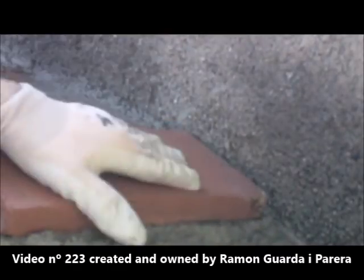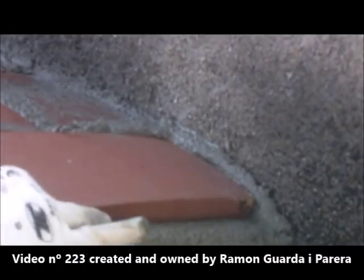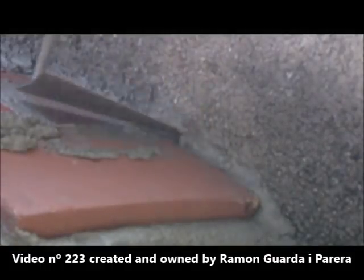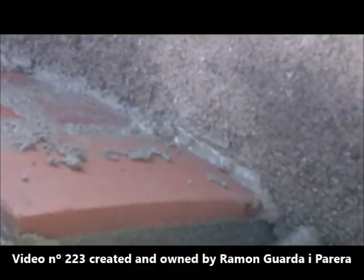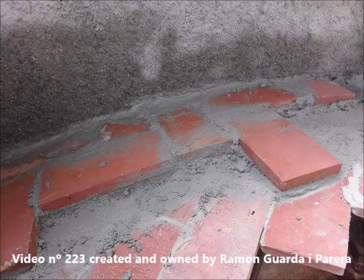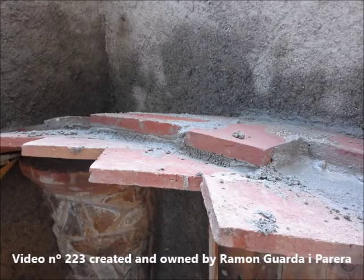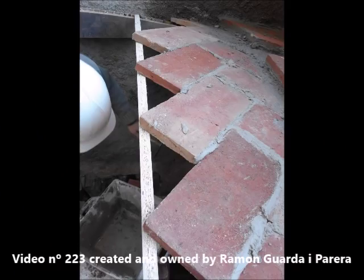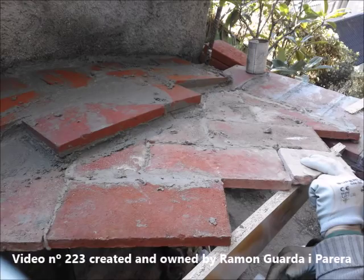The mortar is ready to place the brick. When the brick is placed, at the same time that it is pressed, an oscillation movement is made. This causes the mortar to overflow the sides and fill them. If there is a failure in the filling, it is corrected with the remaining material. Detail of the placement of bricks in the spike, at 90 degrees, so that the joints do not coincide with those of the first layer. Image taken from profile from the right, and image seen from the front, showing the difference in placement between the first and second layer. Detail in which you can see how the tips of the brick match the marks of the template. We are checking the distances for the adjustment of the next row of bricks, using half a brick.